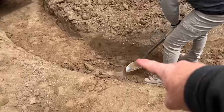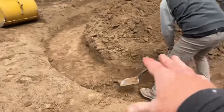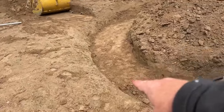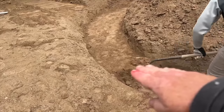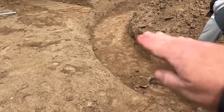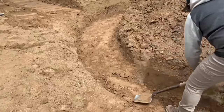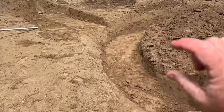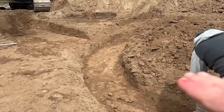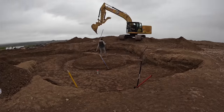Setting the footing for our wall that's gonna hold back that fire pit patio over here. So what we usually do is dig down about a foot, 8 inches or so, just so we can get some gravel in there. The gravel will put a base material down on top of the liner, and then we can come in here and set our retaining wall. The other reason we dig this down is it allows us to adjust the height of that wall so we can get that patio height exactly where we want it. And of course, as we're doing this, it starts snowing.